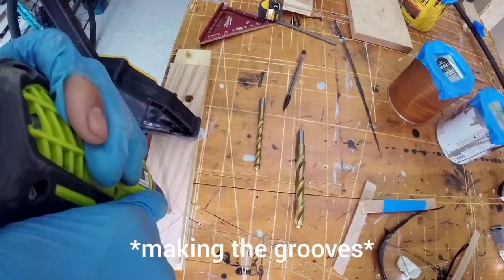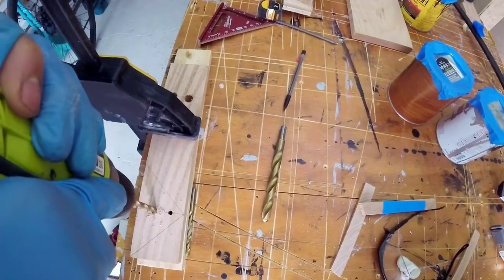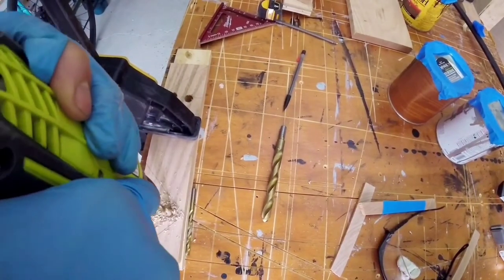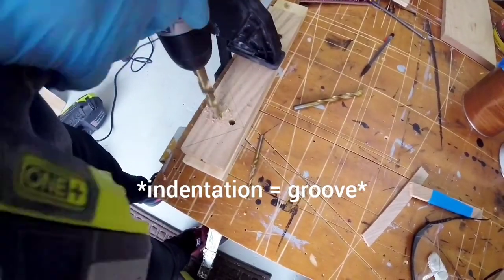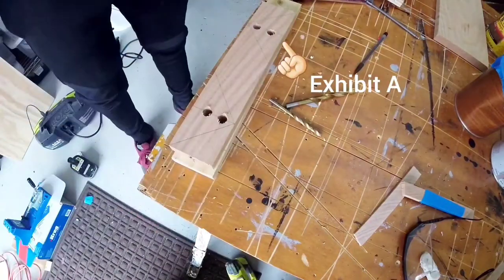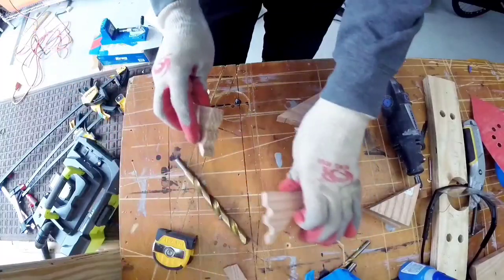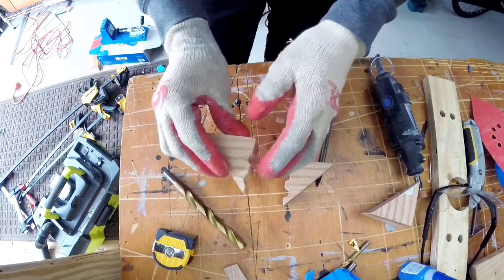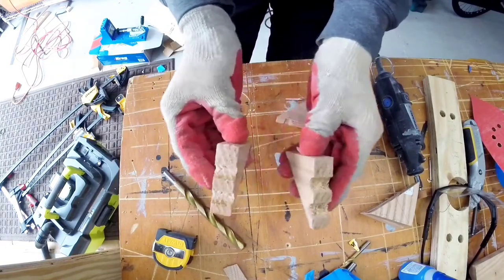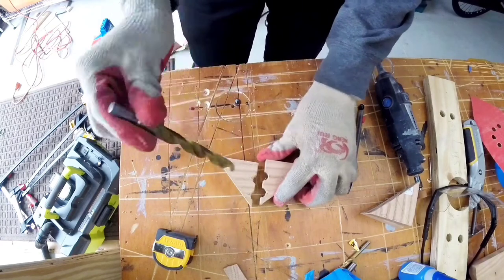I initially tried making this using a drill and a drill bit, using a small bit and then progressing up to a larger bit to make a large enough size indentation on the bracket, as well as making sure the holes are as straight as it can be, because I initially did this using the largest bit first and the holes did not line up. But I still messed up anyway because I cut the brackets not centered, so the indentation was a lot deeper on one end and not on the other.